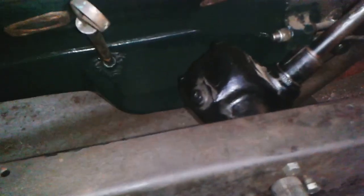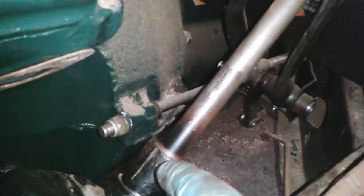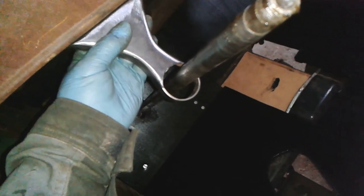I've gone for a little bit of overkill and put four extra washers in all three bolts - so these two have got six and this one's got eight. That's moved the whole thing that way, which has solved the problem there; the shroud fits nicely. But it has pushed the shaft over there now.